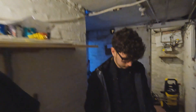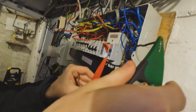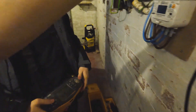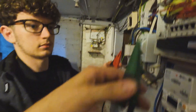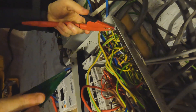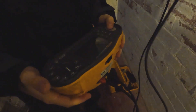Ellis is now doing the ring test. We're getting 0.35 ohms on lines — now swap to neutrals. That's 0.36 ohms, only 0.01 difference, which makes sense as it's the same conductor size. Make sure the clips are on the teeth of the terminals properly. Test result is 0.85 ohms — that's your ring end-to-end test. It's not broken; if it were you'd need to go around all the sockets to find where the ring is split.